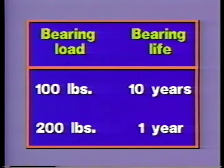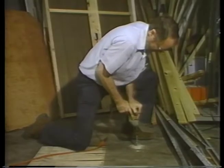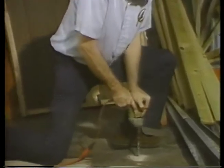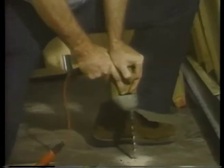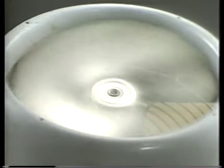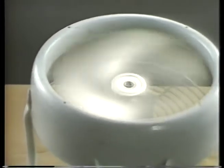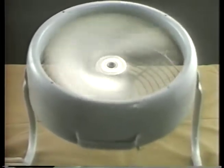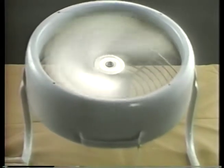Obviously, if the weight is too heavy, the bearing will fail quickly. But shock or impact loads, brutal treatment by the operator, and dull or chattering tools also shorten bearing life. The bearing designers may have expected rough service, but no bearing will take abuse indefinitely. And vibration is very hard on bearings. Machinery will vibrate if anything is bent, out of balance, or loose. The parts must not shake and rattle. They've got to roll smoothly for the bearings to last.